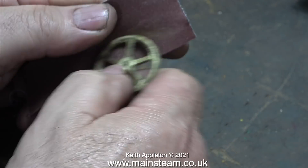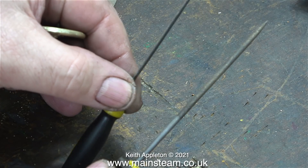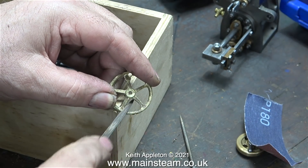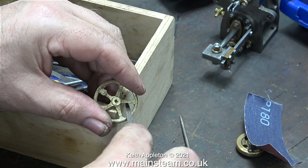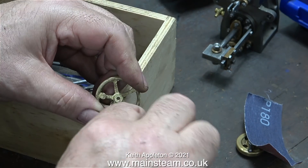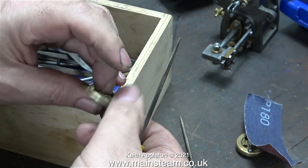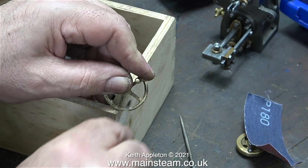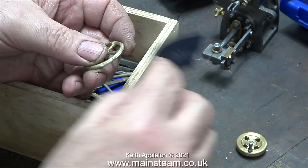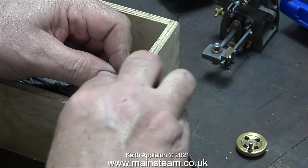This is quite a good quality casting, but as usual it needs fettling. The initial cleanup starts with emery cloth to get a feel for how hard the metal is. I selected a half-round needle file to clean up the spokes — it works for the rounded corners and, turned around, cleans up the flat parts in the middle. This is not a difficult job; it just takes a disproportionate length of time. It's a bit like painting a shed — I'll do part of it, move on, then fill in the gaps — but I generally get there in the end.